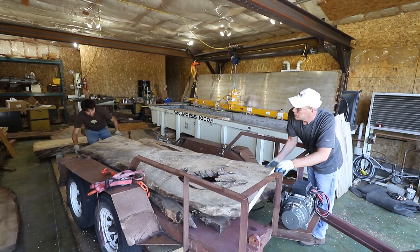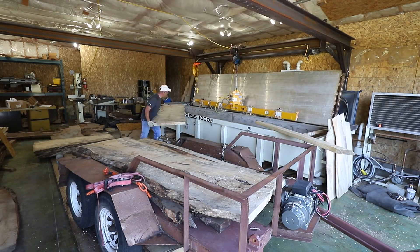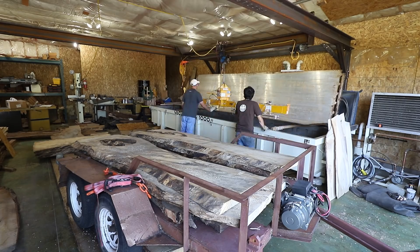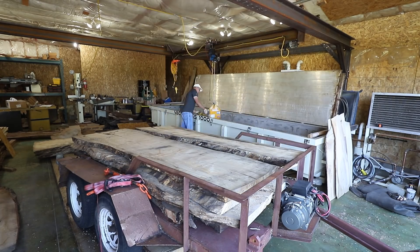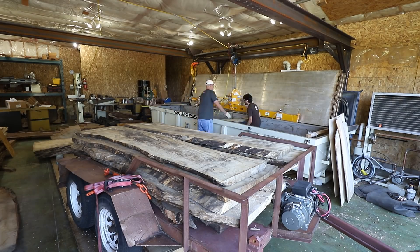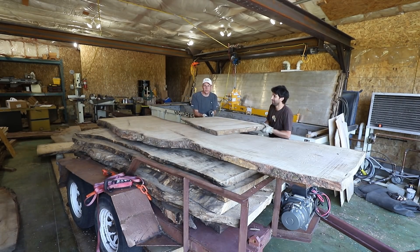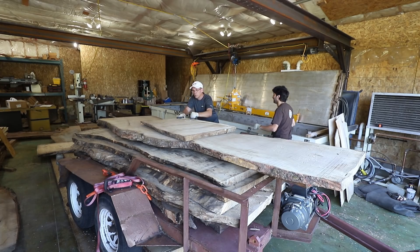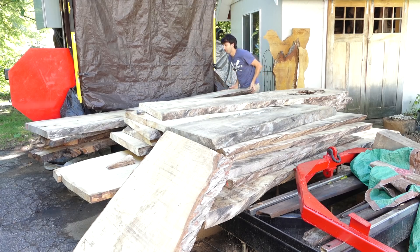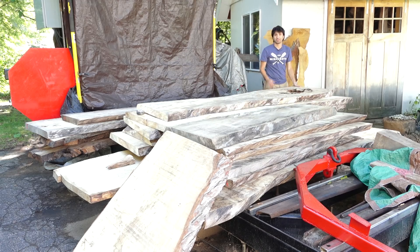What used to be sitting right here was a log of silver maple that was really spalted. Last time I was talking about how I had brought that over to be vacuum dried. Both logs were vacuum dried and that turned out really amazingly well — it was three days in the kiln to go from 15% down to 7%. There was also a green slab cut back in June that went from wet down to 8% in the same time. Overall some pretty ridiculously interesting technology, and I'm looking forward to more vacuum drying in the future.